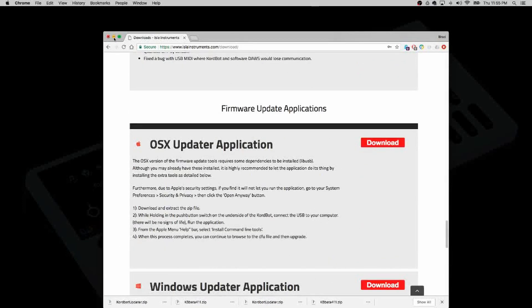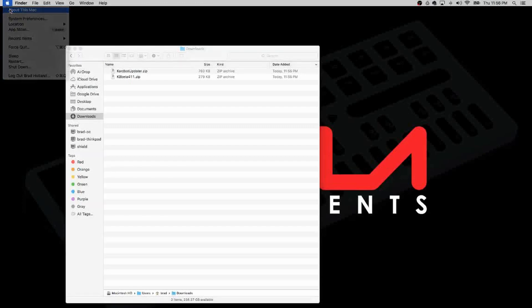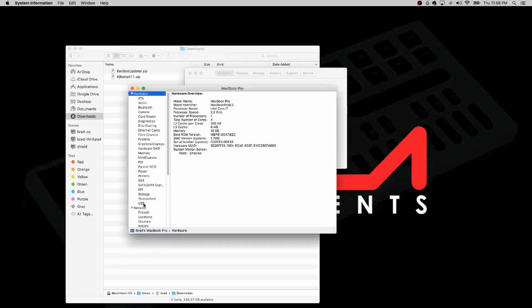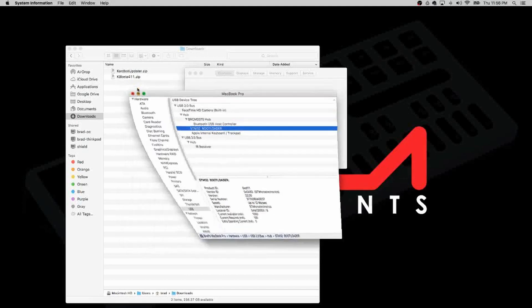Those files will now be in your Downloads folder. As mentioned before, connect the ChordBot to the Mac by pressing the firmware update button and holding it in before connecting the USB cable. While holding the button, connect the USB cable. You can double-check everything is correct by going to About This Mac, then System Report, and looking under USB — you'll see a device called the STM32 Bootloader, which confirms ChordBot is connected in DFU mode and everything is okay.